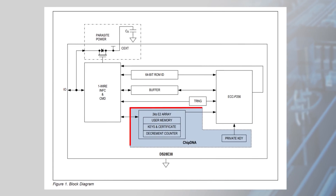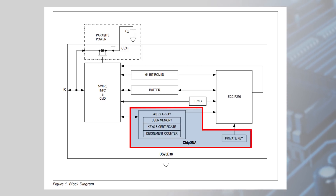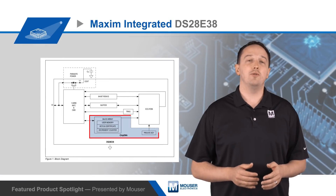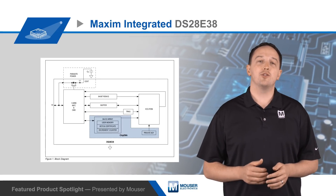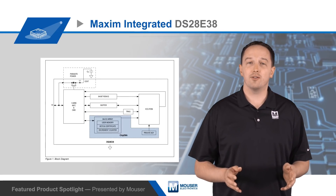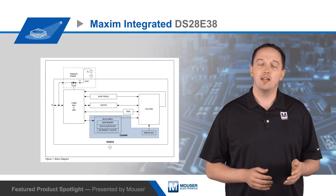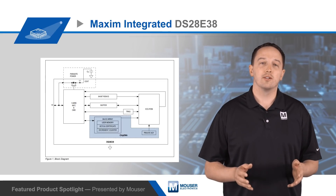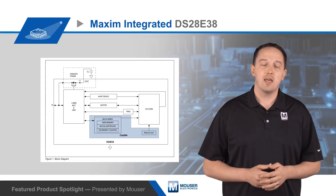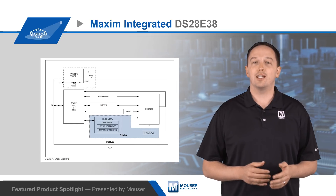First is chip DNA PUF technology, with PUF standing for Physically Unclonable Function. Chip DNA generates a unique key based on precise analog characteristics of the IC. That key is guaranteed to be unique by the circuit design and the natural variation that occurs in manufacturing. The key is generated on demand, so it never exists in a static register or other on-chip storage. And because the key is based on the characteristics of the IC, any physically invasive methods or probing will inherently alter those characteristics and therefore alter the key that is generated. The DS28E38 is immune to all known invasive attack tools and capabilities.